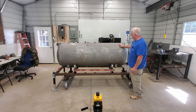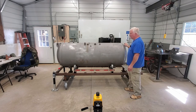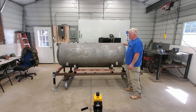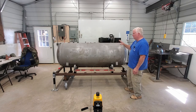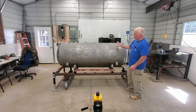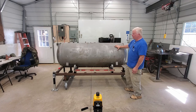This is a 250-gallon LP tank. It should be a little over a quarter of an inch thick, so it's your average mid-60s — I think this was a 1967 tank. All of those in the late 50s, early 60s, all the way up into the 70s are pretty good thick material, and they're pretty good for building tanks.